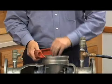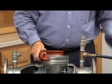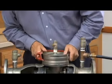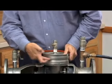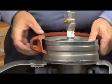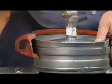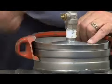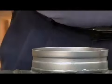One is the groove in the pipe that you see here like this. The second groove it holds is the cover, which sits under the lip like this. So that shows you how this grabs this slot, which is pushed into the tubing, and the outer one, which holds the cover on top. And the gasket sits in the middle of it, just like that. So that's why you can get that great sealing action with two relatively small bolts with the gasket.